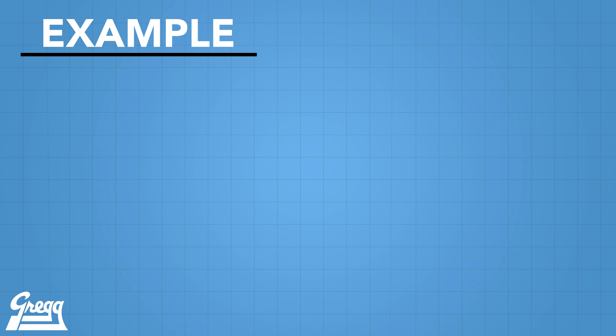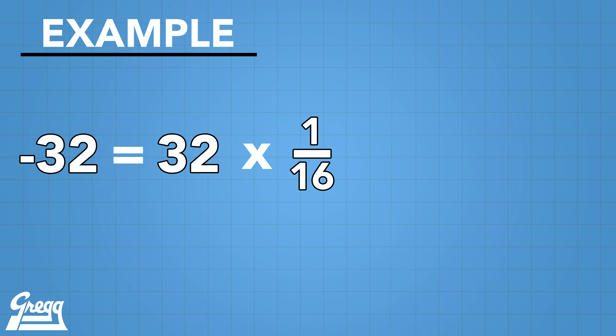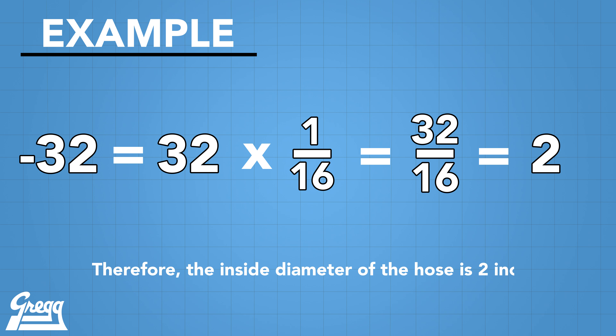Here is a hose example. When dealing with most types of hose, dash 32 equals 32 one-sixteenth inch segments, which equals 32/16ths, or equal to a 2-inch hose ID.